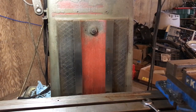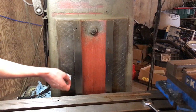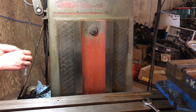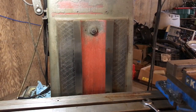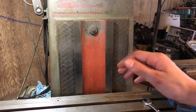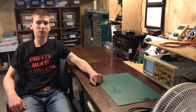When I was cranking it back down I noticed there are some chips on the Z axis ways — once we got that oil pumped it kind of got left and stuck to the ways, so we'll just wipe those chips off. We've got the way lube back on so I don't have to worry about these things rusting. Thanks for watching this video today — hope you learned something. If you did, please subscribe, that would really help my channel, and I'll see you next time.